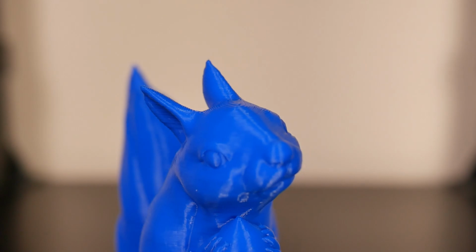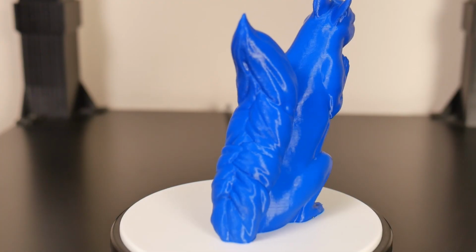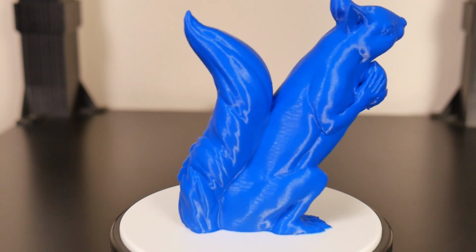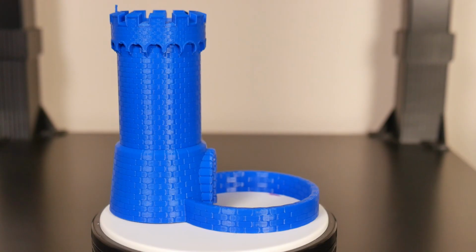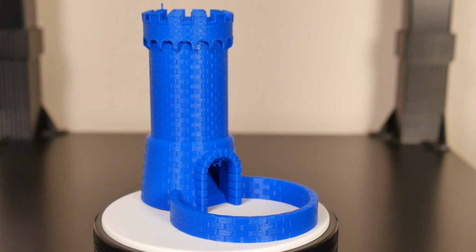I mean, all in all, I only did test out PLA on this. I don't do a lot of ABS printing, and PETG printing you can do on machines that do not have all metal hot ends, but I've been doing less and less of it. If you're getting close to that 245, 250C, then you really could be getting into the melting temperature for the Teflon, and if the temperature sensor is incorrect and it's off by 5C or something like that, then you could really be melting the Teflon, which is not something that I want to do. So I just did PLA.